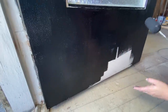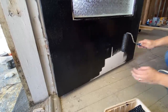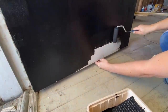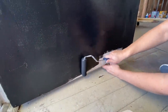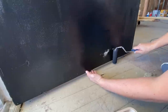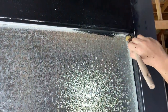Some people wonder why I choose to use DIY paint on things like doors over a traditional latex or oil-based. The reality is the DIY paint just goes on so much smoother and it's not gummy or yucky. When you've got so many years of latex paint on a door I just hate to add any more to it. I feel like this reacts a little bit better and it's worth sealing it to protect it over time. To get down into the details I'm just using this French round brush — it makes it really easy to get all the cracks and crevices.